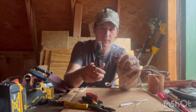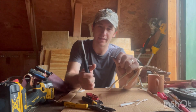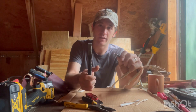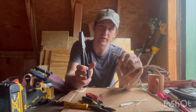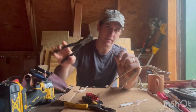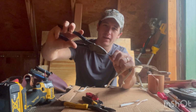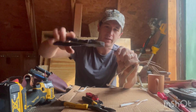You line up your copper, and this is kind of a finesse thing. You'll get a good feeling for it, but your joint, where the wires are connecting, is right here. You're not using your wire nut to connect them unless it's stranded, but for the sake of the video, we're not going to go into that. This is just solid copper, how to make your connection. You grab hold, not too tight, and you just start to nice and easy let them twist around each other, okay?